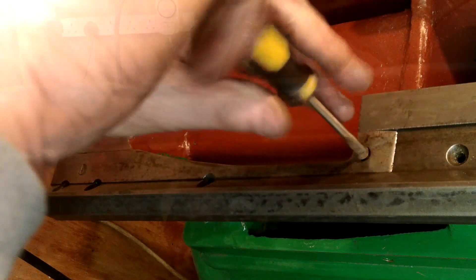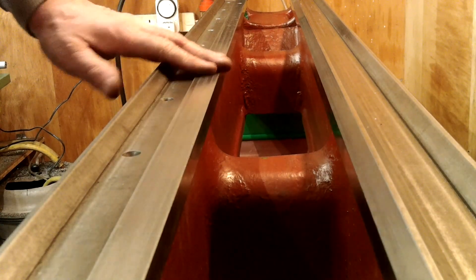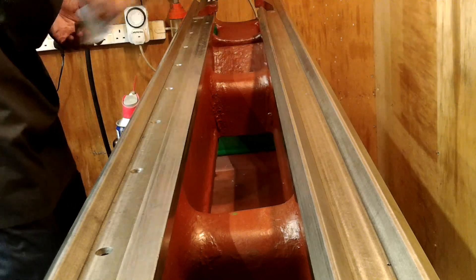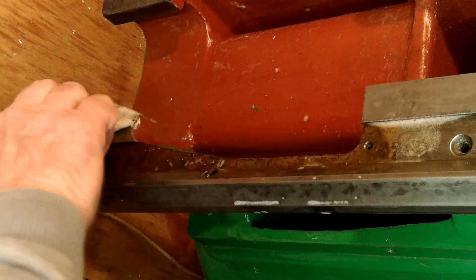But before I can get going I need to remove a filler plate and clean all the ways. My oil or suds tray hasn't got a drain hole in it yet, but if it had I would make sure that my suds tray remained biased towards the outlet hole. For now I'm just going to make sure that the main bed is set up without any twist as best I possibly can.